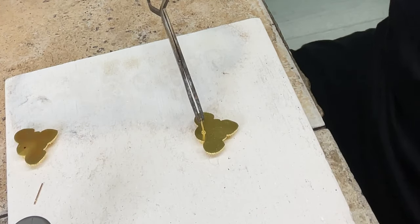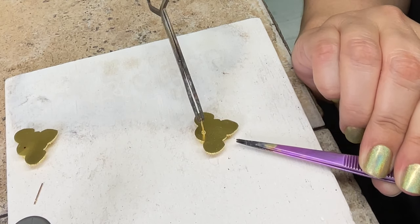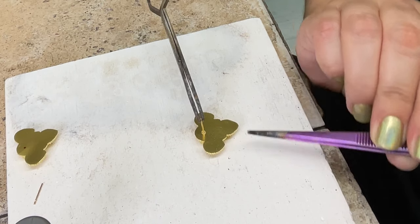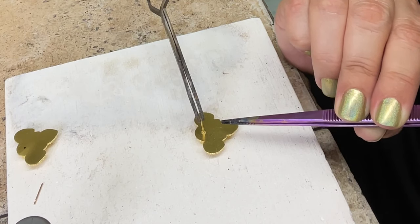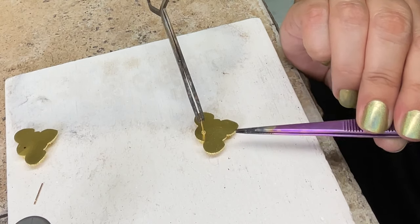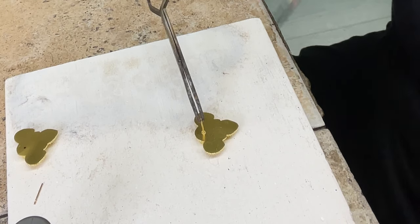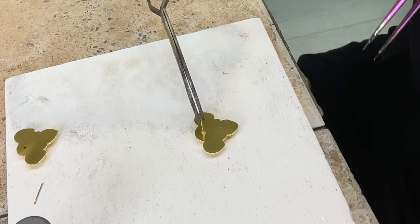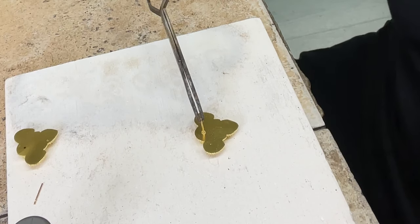When I solder this, I'm going to position my heat parallel to my block and hitting the piece. That's the whole mistake — people will be up here with the torch pointing down, and if you do that, more than likely you're going to hit the post and it's going to melt. I keep my heat on the piece. Once the solder flows, I might bring my flame up for the tiniest of seconds just to make sure I get a nice meniscus — that little volcano that forms around the post. But if you stay on the post at all, bad, naughty, terrible things will happen.